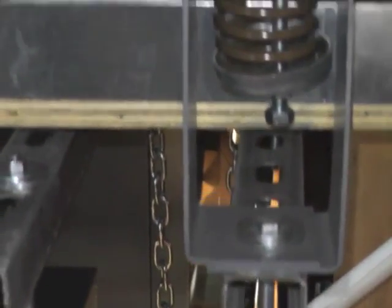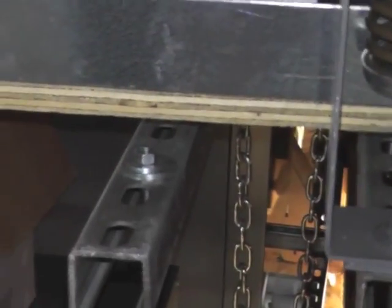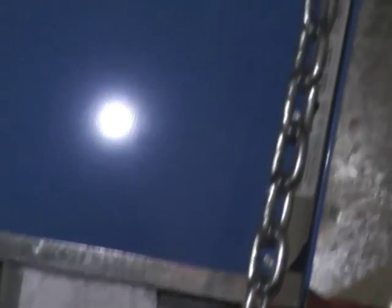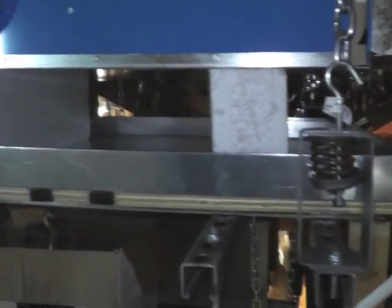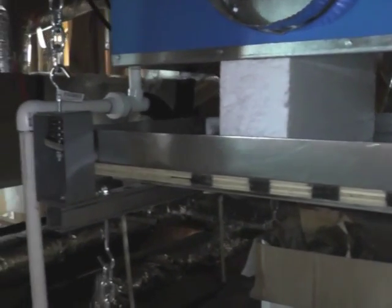Weight rated inline vibration springs coupled with a carefully constructed frame of Unistrut keeps the weight of the heavy geothermal heat pump up off the garage or attic floor. Strong chains transfer the weight of the unit to the rafters, creating further vibration isolation and eliminating any potential vibration from being transferred to the house.